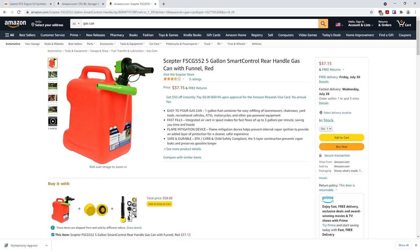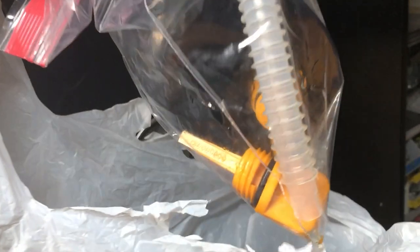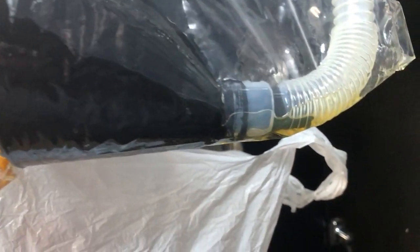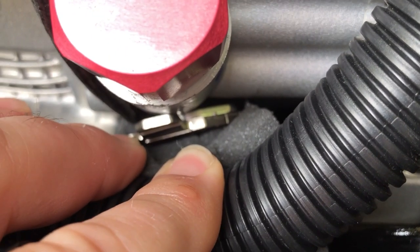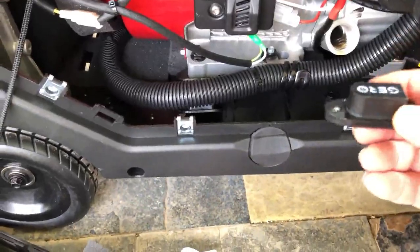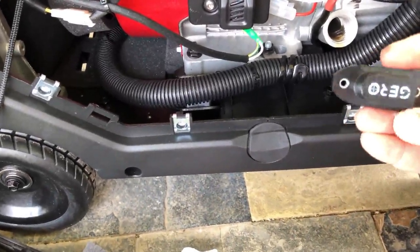You'll also need to provide fuel stabilizer and fuel. Keep in mind, once you've used that funnel it's going to have oil residue on it, so expect to need to keep that bagged — trust me, it's going to make a mess. And speaking of oil, this brings me to my first real warning with regard to these generators: get a magnetic dipstick. Or if you really don't want to spend the $30 or so to protect your $2,000 generator, at a minimum put a really strong magnet under the area where you fill the oil.